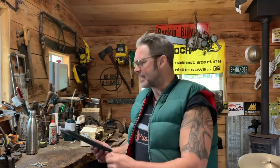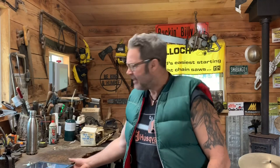Kenny S. again, nobody. My God, when you were racing your son, it looked like you had a laser going through that tree. Friends, that 371 that Iron Horse made me, that sucker was cutting. People get excited when they shave their rakers right down and the saw pulls them into the wood. That's great in wood like this, I agree with you. You crack them down. You get into something like this, guess what? It ain't happening unless you got 150 horse off the end of your finger. The raker thing, that power saw, believe it or not, I think I showed it in the video. I did show it in the video. My rakers were literally like, they could have used a hit if I was bucking smaller wood. Truly. They were high.